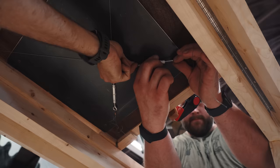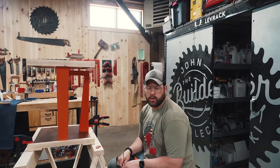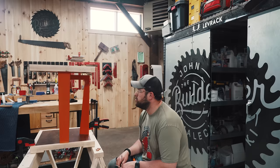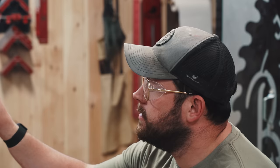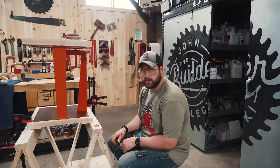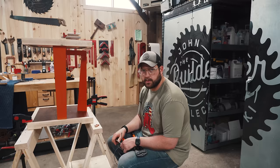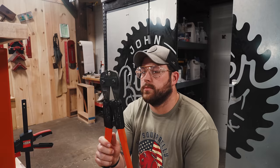It's broken. After continually breaking this thing over and over, I've reached a few conclusions. One, the metal parts are weighing a lot more — the top and bottom probably weigh 20 to 25 pounds. The string's tensile strength is like 70 pounds and it is braided metal wire, so I thought it would at least be able to hold itself, which it obviously couldn't. So I went and bought from McMaster-Carr a 3/16ths braided cable rated for 800 pounds. Problem is it's 3/16ths so it's visible, which I hate. I also had to buy some ferrules and a $250 crimper, which makes me sad. Now we have to figure out a way to get this cable in and make it look decent.